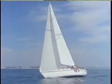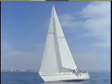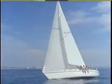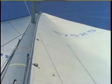Now let's adjust the draft for special conditions. First, very full for light air and sloppy water, then flat for a fresh air beat in smooth seas. The full setting looks like this. We have eased the outhaul 3 inches and the shelf is partway open. The mast is almost straight and the Cunningham is off. This setting develops maximum drive out of a low horsepower breeze.